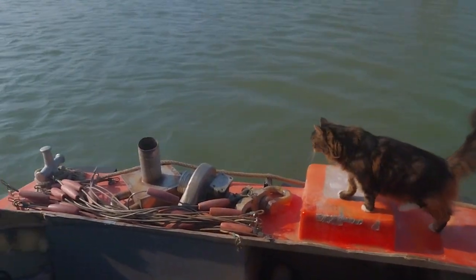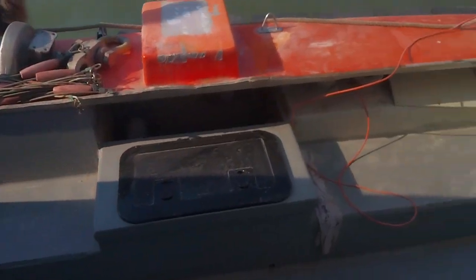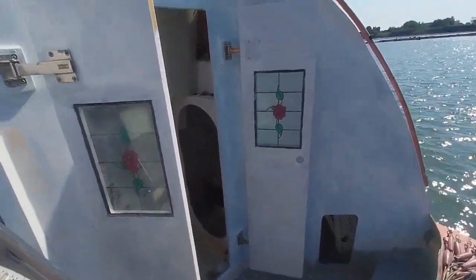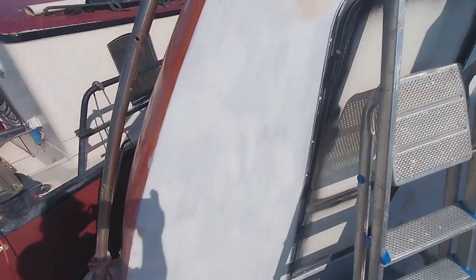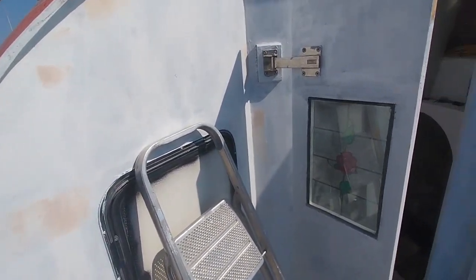The cat loves the boat, which is good. So yes, I'm going to crack on today. Another look at the cockpit — it's had a first coat of white primer. Still a little bit of filling and fairing going on. You think you've got it spot on and then when you paint it, you find other bits that need doing.